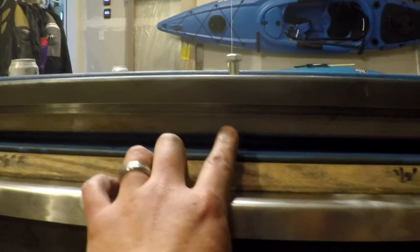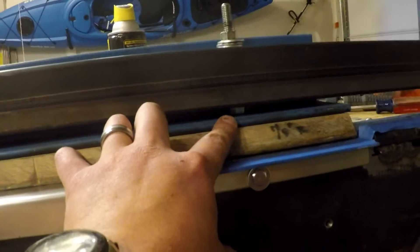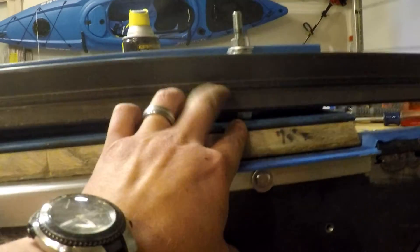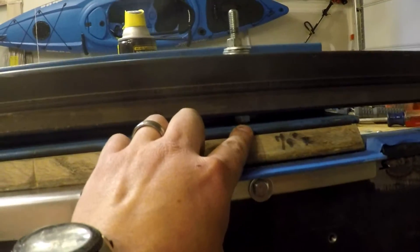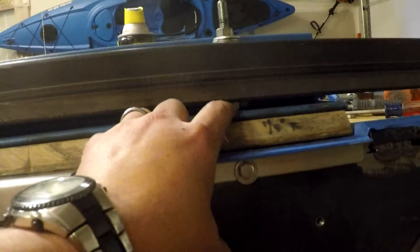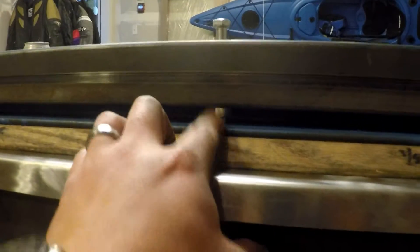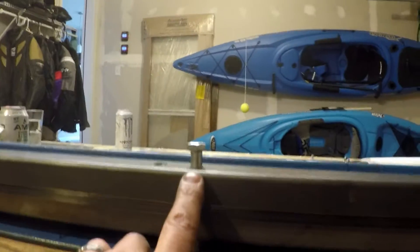With the square tubing, it's bowing up in the middle — in what's considered the center of the workpiece — even though I'm only using maybe two-thirds of the brake. It's bowing quite a bit in the center, less so at the ends, and then it's down on the nuts I'm using as standoffs to keep tension. I just used three-eighths inch nuts, reamed them out so the clamping bolts pass through — they're just standoffs to maintain tension on those clamping ends when you thread the bolts down through the actual threaded nuts.